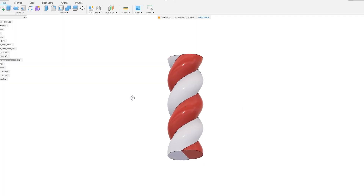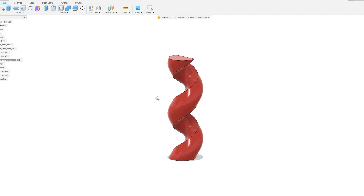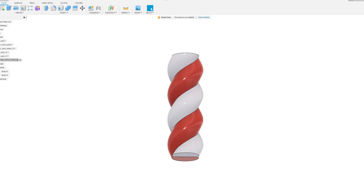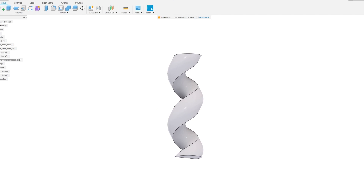This is gonna be a spiral candy cane pole so that each section as it spirals up is walled off and separated from each other section. When we put the LEDs on the inside, it's gonna get diffused but won't cross across each of the boundaries, so it'll be discrete sections for each spiral. We can get really clean red, white, or different colors. First we need to go to the computer, design it out, break it up, figure out how big we can print each section, and see if we can put it all together.